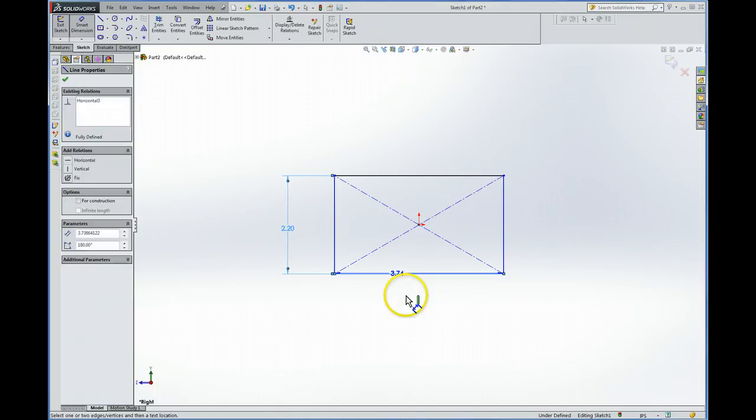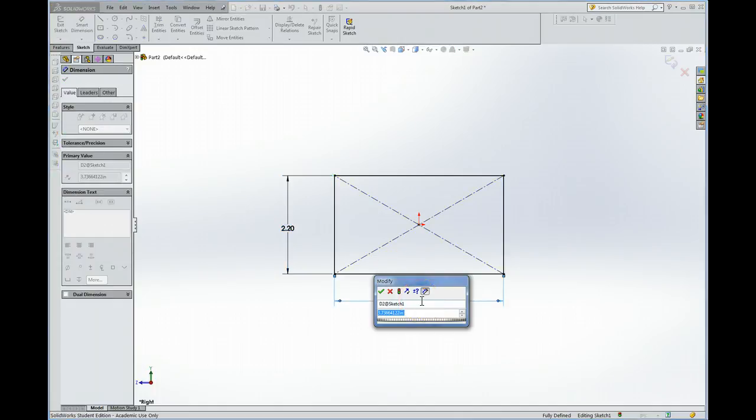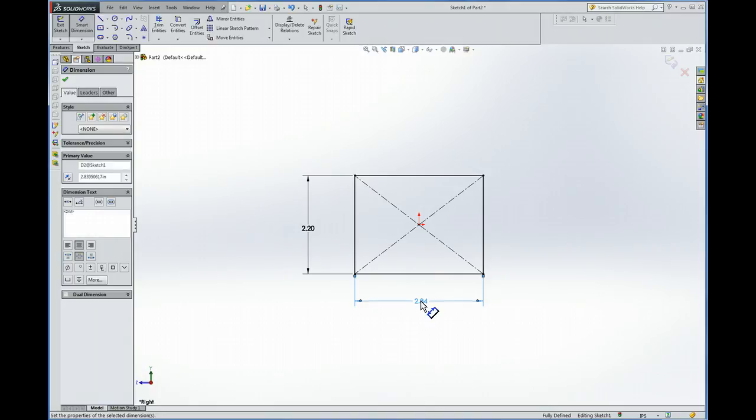Now for this dimension, again it's arbitrary. I'm going to make mine the golden ratio of the front width, and that means that my top or lid will come out as a golden ratio rectangle. So this is going to be 4.6 divided by the golden ratio 1.62. Now that's just a rough number, 2.84. Of course that is not a multiple of 0.2. Not that it has to be. You could do this side face differently, but it's probably easiest if we make it a multiple of that.